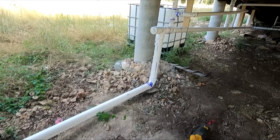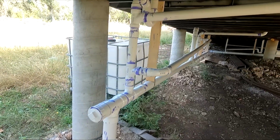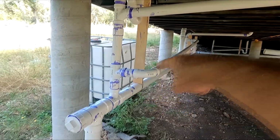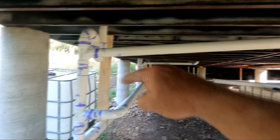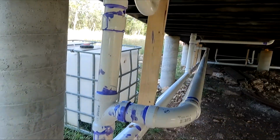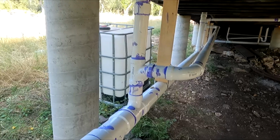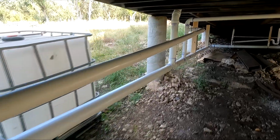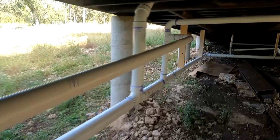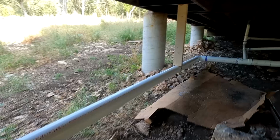So here's the main pipe, main sewage line. So I did a little constructive venting. You can see this pipe right there. So you got the trap, you go down, and this vent pipe actually goes out to the sinks, which is vented to the attic. So it's a shared vent. It might look funky, but I don't know, it should work. And down there, oh man, I just whacked my head on the ceiling here.